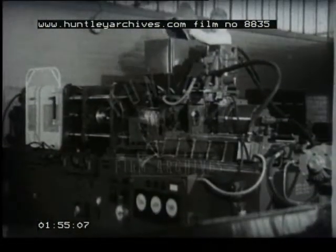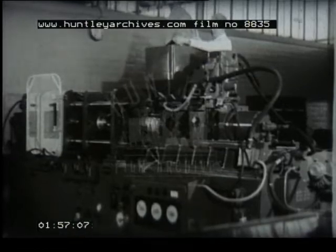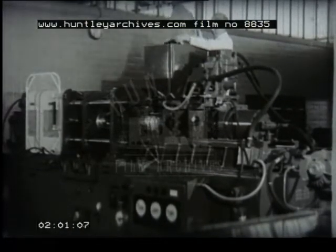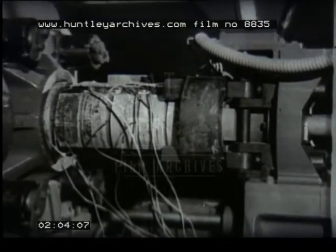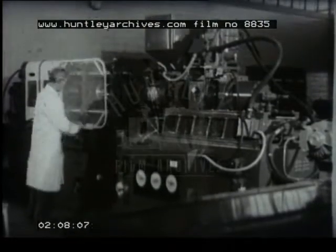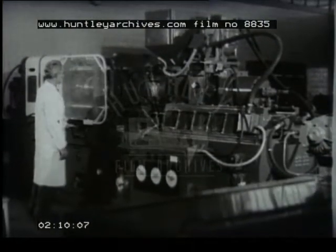In this case, polythene is being used to produce a washing up bowl. The moulding material in the form of granules is being put in the feed hopper of a large injection machine. From the hopper, it passes into this cylinder where it's heated and becomes fluid. This machine is a special design to increase the rate of heating and to make sure the material is all at the same temperature.